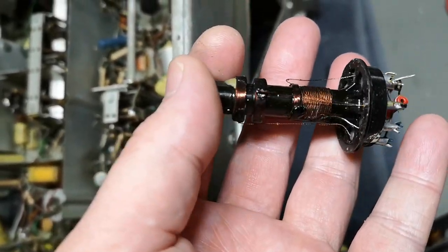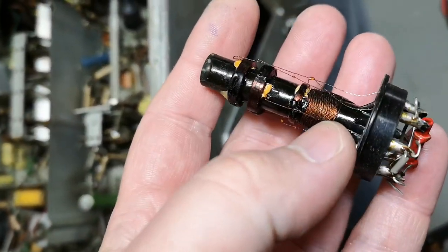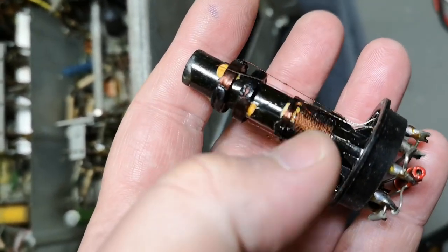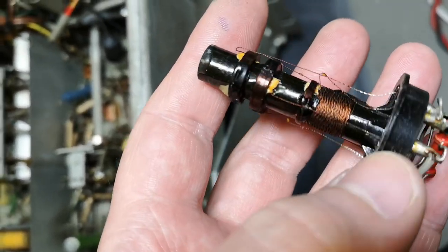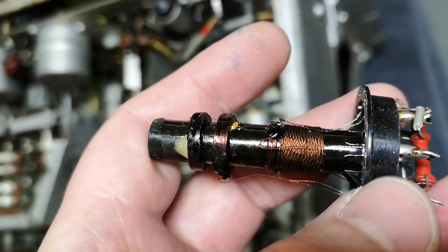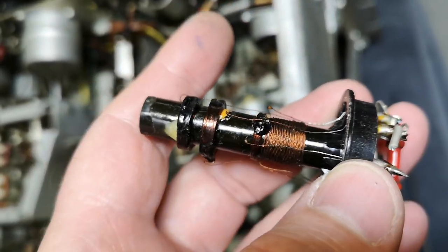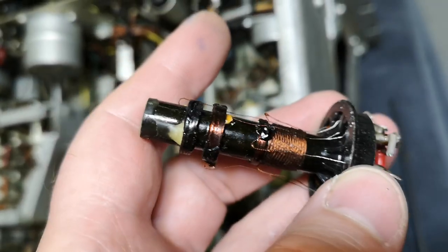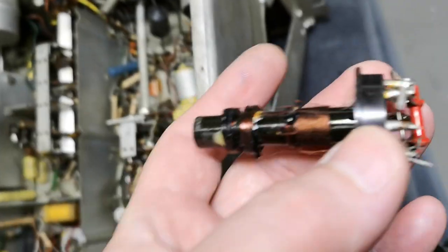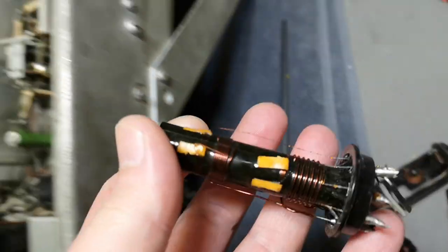Look how many inductors they are made of. And the winding style here is really, really nice. This cross winding technique is a little bit special, but this is to minimize capacitance between the layers and this way get a higher Q factor. And they're all very, very different.